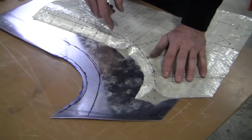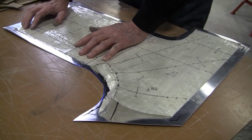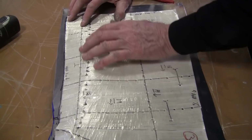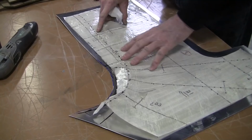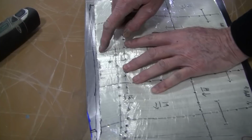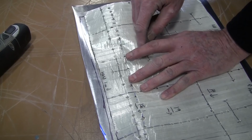We can put a little added area right in here. We'll fill this up a little bit. Well, how much? Well, you fill this up until it starts to get tight. And if you go too tight, the edges will get loose. So say you overdevelop that right there, and I'm representing that by putting the paper in here. What will happen is you'll have a really tight spot right here, and then you'll see that the edge will get loose right here. Wherever the edge is loose, inboard it's going to be super tight. There's your problem.